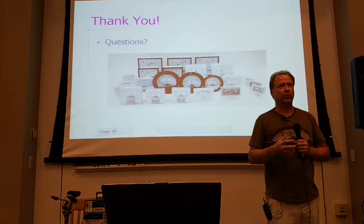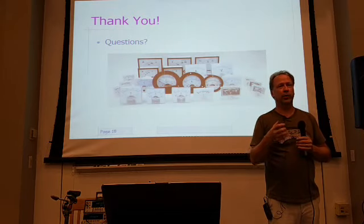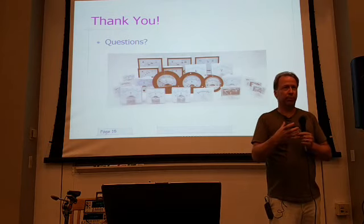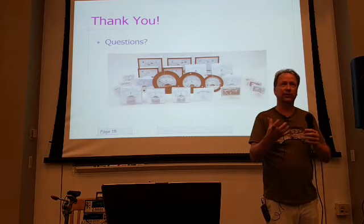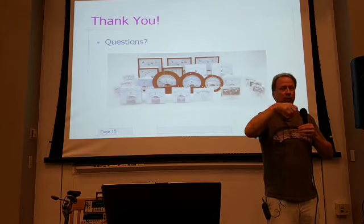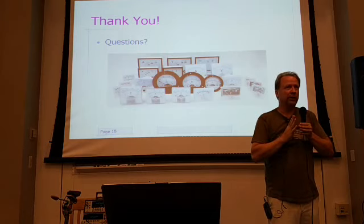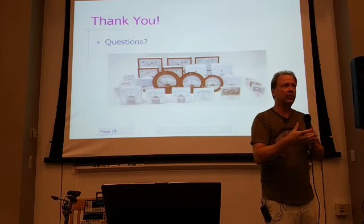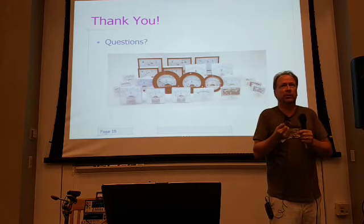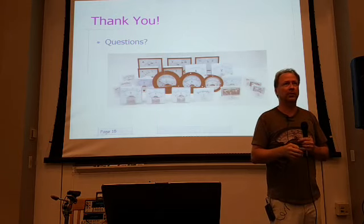A lot of it comes down to the robustness of the design. If you look at a reputable brand like a Fluke, these things are built like a brick shithouse. They're very, very robust. Where the connections are made for the banana plugs, there'll usually be reinforced connections, and isolation cuts made in the circuit board to prevent arcing. All these things make the meter last long, so you can plug and unplug the probes 5,000 times, and it'll work just as good as the day you got it.